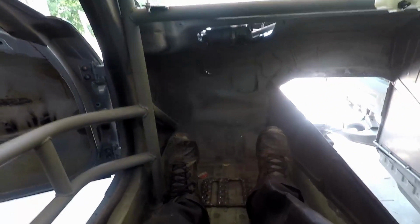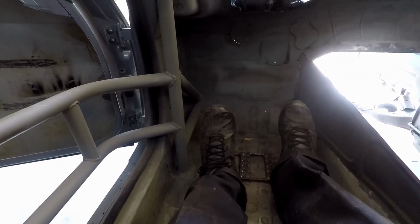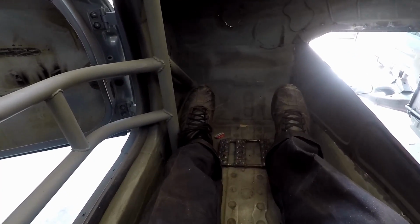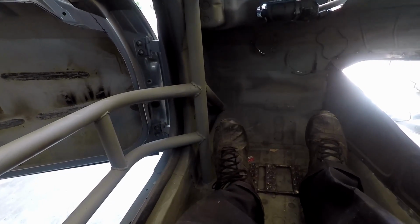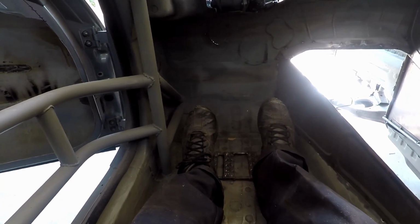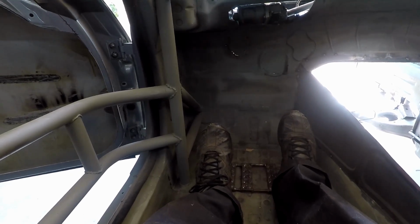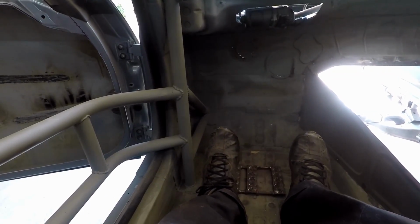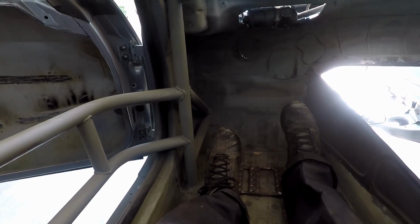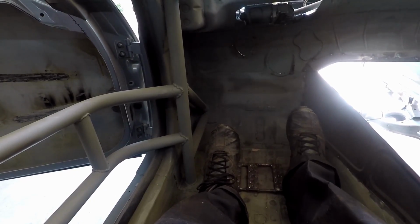That means the gas pedal would be right there, off to the right of the bolt holes, and the clutch pedal would be right here, with just enough room for a dead pedal. So it's going to be pretty much right there. The pedals come about 3 inches forward of the furthest hole, so actually they'll be here, so it's got to go back a little bit. If I had it adjusted all the way out, the pedals would sit about here.